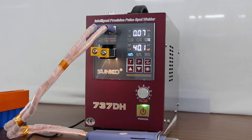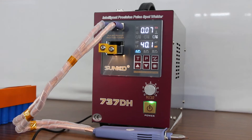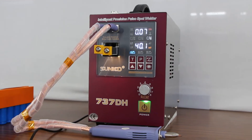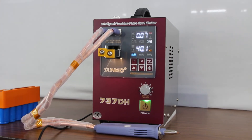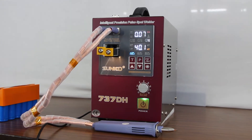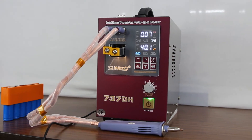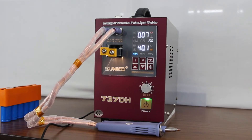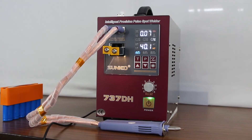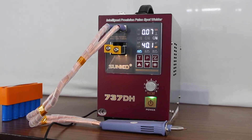This product is used for the lead wire of battery, lead wire of circuit board, welding metal parts, welding lead wire of metal cells, or DIY projects. This machine has a single phase power supply, total power of 4.3kW, welding current range of 120A to 1200A, 4 types of pulse — 2, 4, 6, and 8 — and a total weight of 5kg.